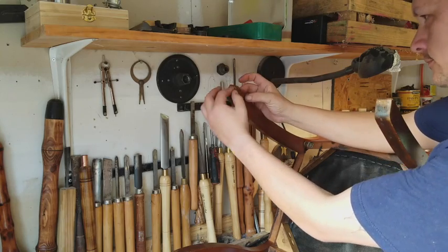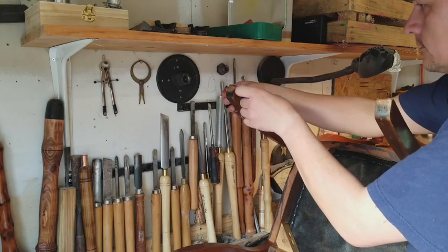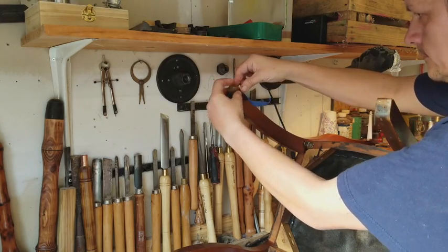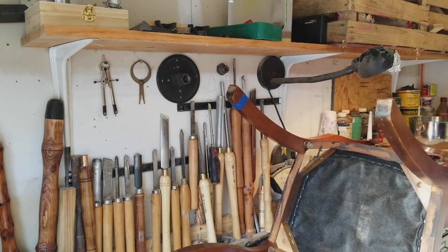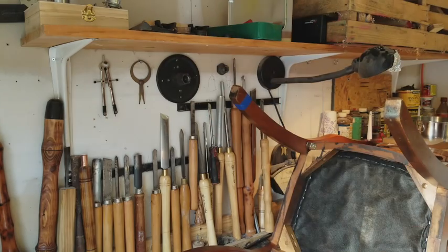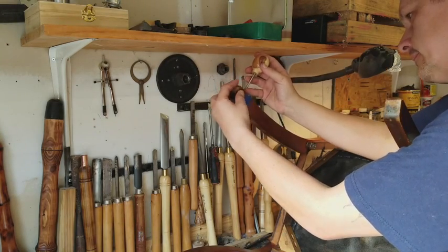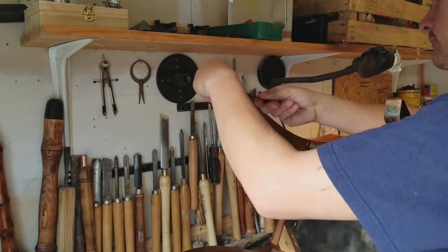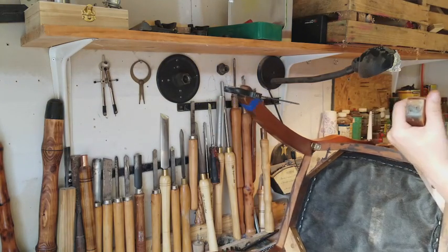So I basically just went through the exact same process with the footing, just trying to find a good angle, making sure that I don't drill too far and that everything is lined up before I drill my hole. Drilling the hole before I use any glue helps make sure that the screw goes in and clamps it down exactly where I want it before I apply any glue. The process is exactly the same — I use the same dowel, I use the same stain — and hopefully it gets the rigidity that it needs, because that particular area right on the footing obviously is going to be receiving a fair amount of stress. But overall the project came out very nice. The client seems very happy with the work, and I think the main point of this is just to show new woodworkers not to be afraid to take on new challenges and just trust what you've learned — and what you don't know can always be found on YouTube. Thanks for watching.